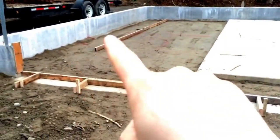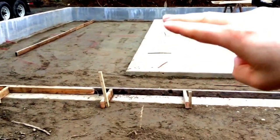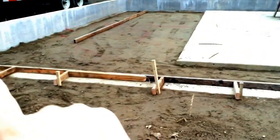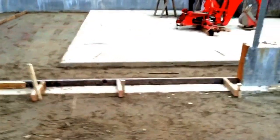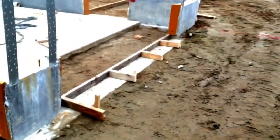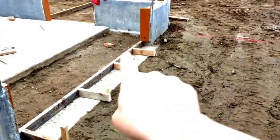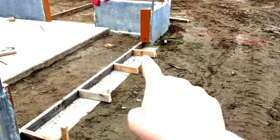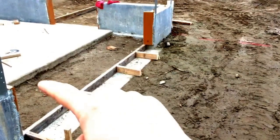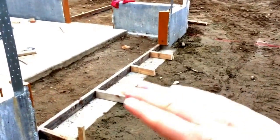It's Tuesday and we've got some of the forms up to get ready for the flatwork that'll be this Saturday. This board here — we'll put another board in here and screed across from this concrete over to that board and that'll give us a nice flat surface. This board along here is the front edge of the garage — it puts the seam right under the garage door so when the garage door's closed it will cover up the seam. The finish in here is nice and flat and the finish out here will be brushed. A lot of times you'll see this board six inches farther back, and when the door is shut you'll see the finished flat concrete sticking out from under the garage door — I don't like that look. I'd rather see the nice brush finish out here when the garage door is shut.